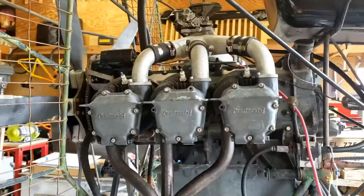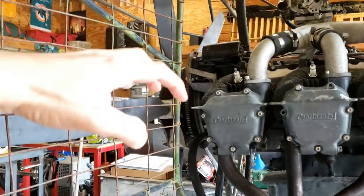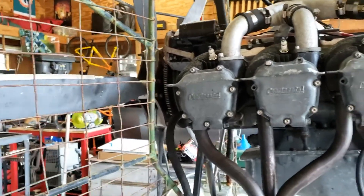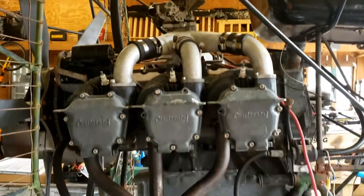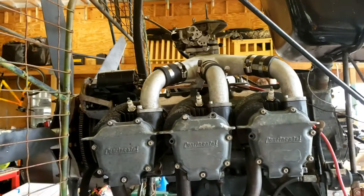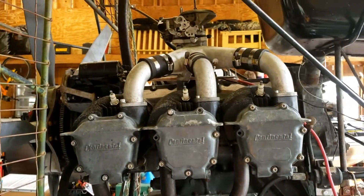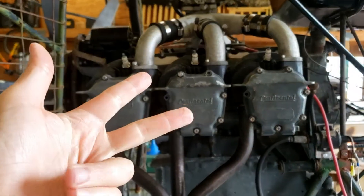What is going on everybody? Clearly we're not running yet. The starter's been rebuilt, it's cranking good. The fuel system is good, fuel pump is working good, carburetor's working good. So then it's down to — of course you always hear — fuel, air, spark.